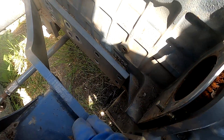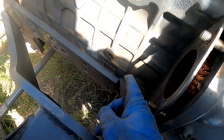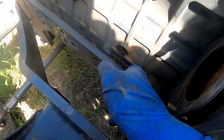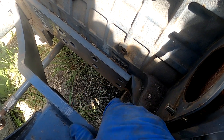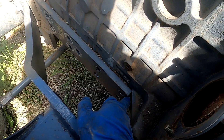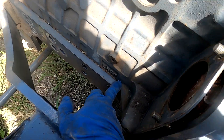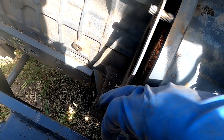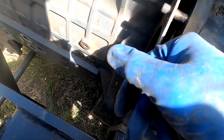It's not too heavy. Unfortunately, as you can see, we didn't have enough clearance for the engine to come out forward all the way, just because of this gusset on the side of the block. And we have this frame rail, so it didn't come out. We have to clear out the studs — still a half an inch. Hoped for the best, didn't work out.